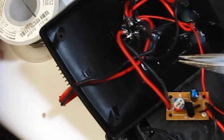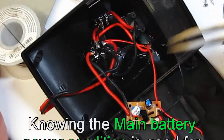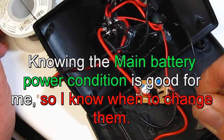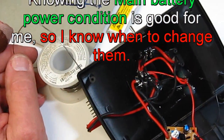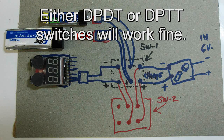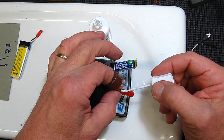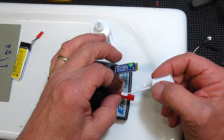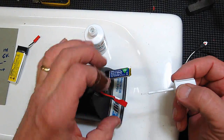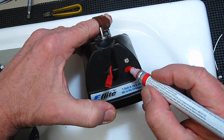I just realized there's an added bonus. By adding an extra switch here — a double pole, double throw switch — that will tell me the voltage in the main batteries. It's a little bonus, and now I'm going to hook up the red wires right there so you can see how that hooks up. Here's a schematic with both switches shown — make sure you study it carefully and you'll see how I did it. I know which side's the plus side — I usually paint a little white marker over here so I know my plus. I put a red dot here so I know that's down.